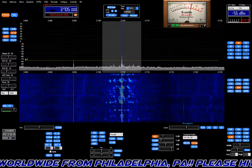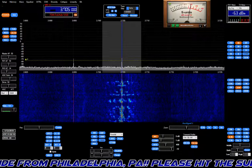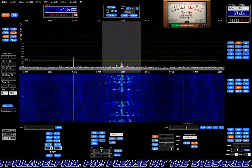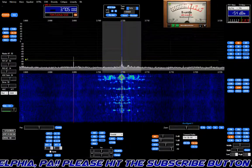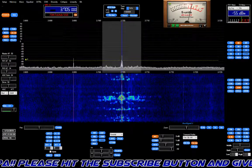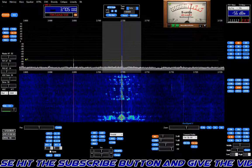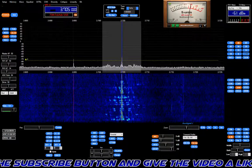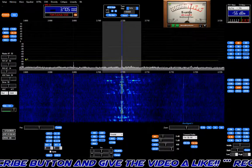And I had a different bias supply, but it was an old tube job. It was variable, and you could supply up to 220 volts of bias, and of course the 813s required quite a bit more voltage than the 833s, so that worked for a while, but then that thing went belly up, and it just wasn't worth trying to get it working, because it was an old tube shunt supply.